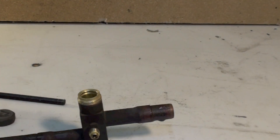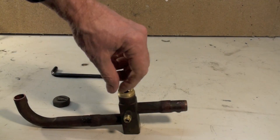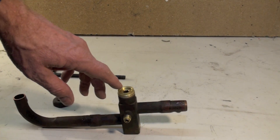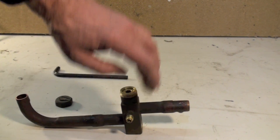This is how you get them as closed. So when you open them, you turn this plunger all the way up — it's not quite this high. There's a little clip that goes in here to hold it from coming up too high. At that point, the only thing that's sealing is that O-ring, because now we have communication from here to here and here.